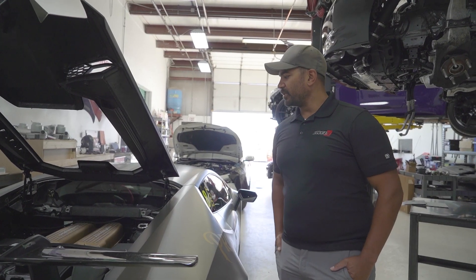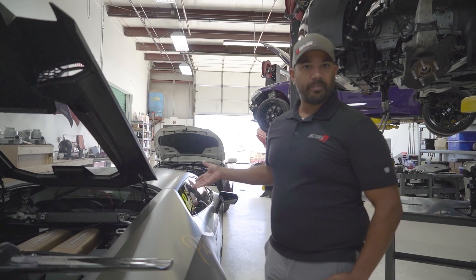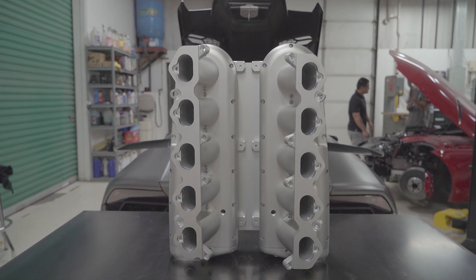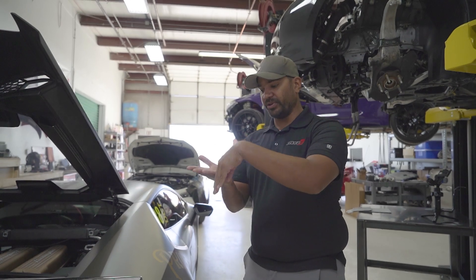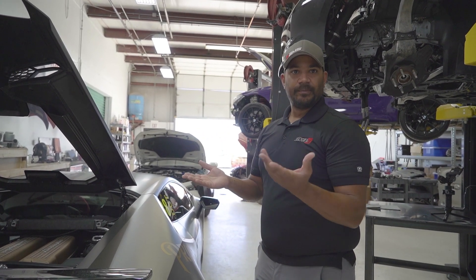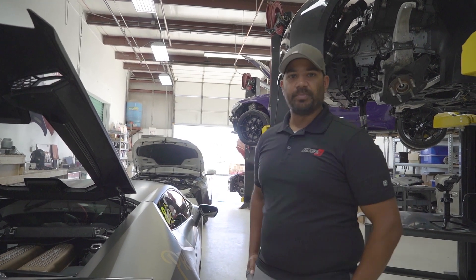Since we're building motors here, you get things like the exact cylinder spacing — a bore is exactly this far apart. All your mounting points and port geometry are very important — not only the actual face where the surfaces mate between the manifold and the motor, but the actual angle that port goes in. A port won't necessarily be perpendicular to its face; it might be angled. So if your manifold comes in at the wrong angle, intake air takes an abrupt turn, you get a pressure drop, and it's less efficient. You want to accommodate that and have nice smooth geometry going into the combustion chamber.